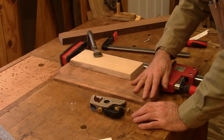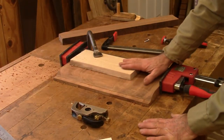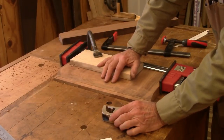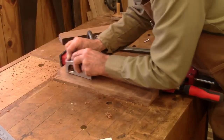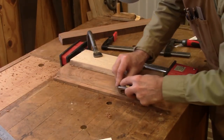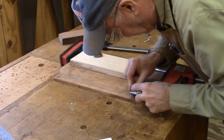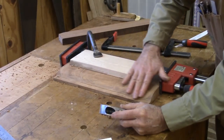I'm working on the blocking of the front drawers — three of the front drawers here, this is the left side. What I did was I cut the rough curve on the band saw on each of the drawers, and now I've got them clamped together so that I can clean them up. I'm just using a small plane here. I'd use a hollow but I don't have one large enough to fit that curve. Once I get them close, I'll be using a scraper to finish them up. This is one way to see that they're all the same shape.